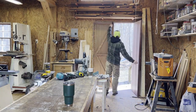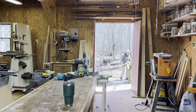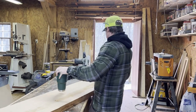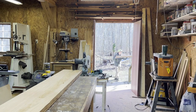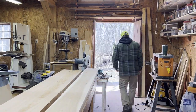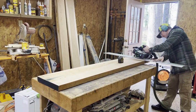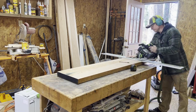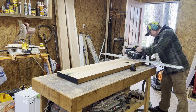Alright, let's get this bed started. This is going to be a castle joint style bed — also a king size bed. Just like any other good woodworking video, let's get the lumber out of the truck and into the shop. The place I got this lumber from is a local hardwood store, and I got eight-quarter cherry — eight-quarter being two inches thick.